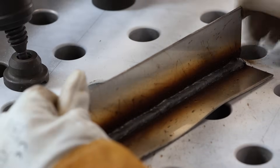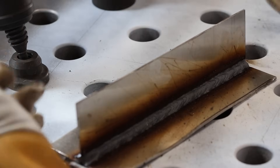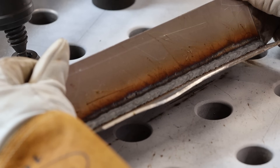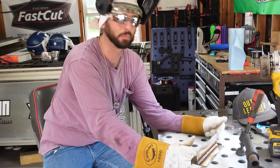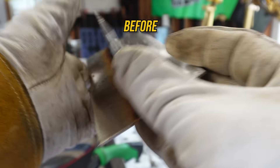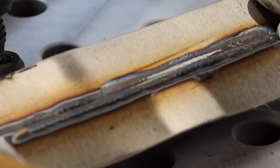Taking a closer look at the weld, we've got a nice bead — had a nice push angle, though the size is probably a little bigger than I'd like. There are still BBs on the plate. I didn't use any anti-spatter on the material itself — I recommend using anti-spatter religiously on everything you're doing with stainless MIG because it throws a lot of spatter. You're not going to see those pretty golds and blues and purples with this weld. This isn't about aesthetics — this is about production. Afterwards you're going to have considerable post-weld cleaning: a wire wheel, a passivation system, maybe a 3M cleaning strip wheel. But you still have those same stainless properties as if you TIG welded it. It's just not as pretty.